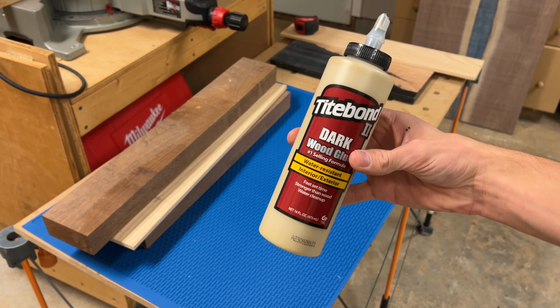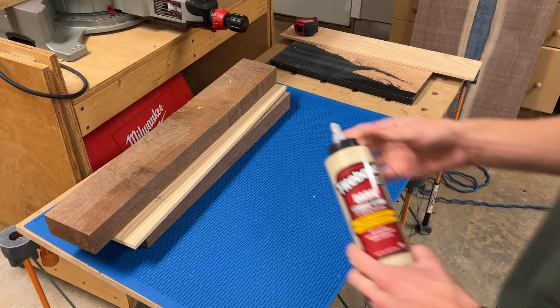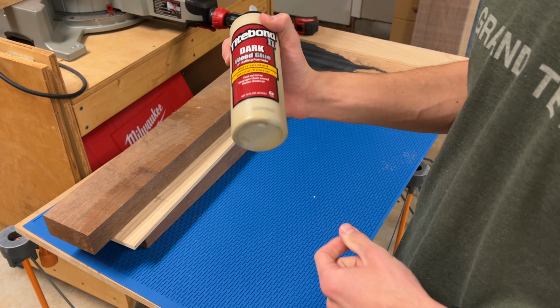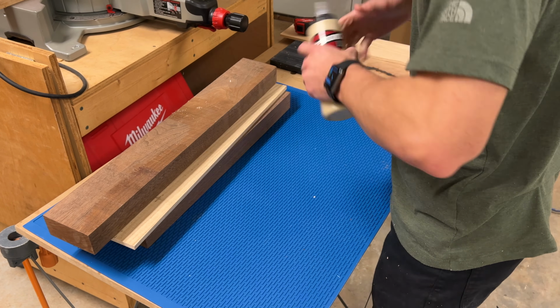I'm going to use Titebond dark wood glue for this, since we're using a lot of black walnut. This dark compound that Titebond makes, it just kind of hides the glue joint a little bit better. I'll link it down in the description.